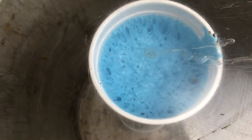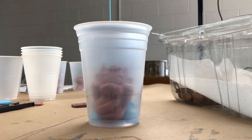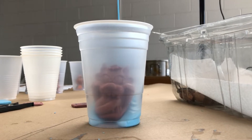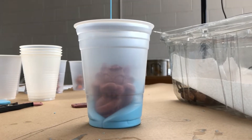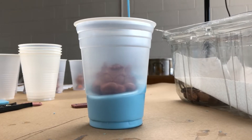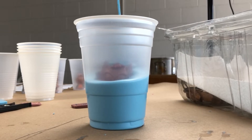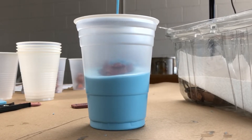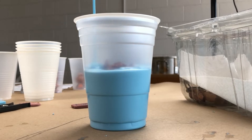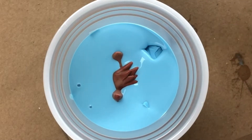That's done, let's pour it. This is sped up considerably — the pour goes fairly slowly. I always pour molds so that the rubber rises from the bottom; that way air is pushed away from the model and out of the cup. I mixed the correct amount of rubber, but I'm going to underpour here to show a technique.